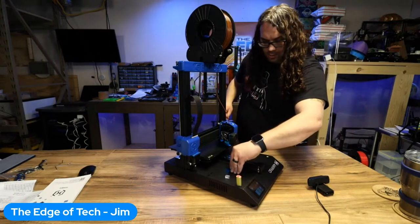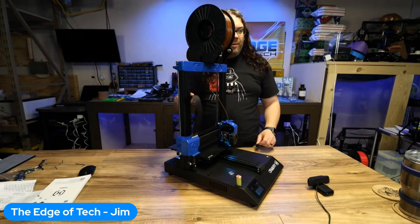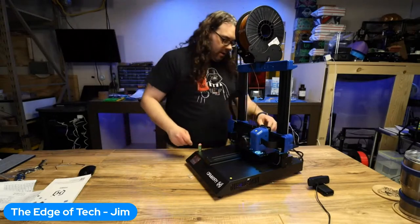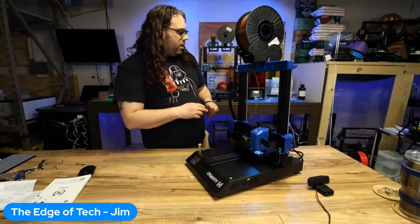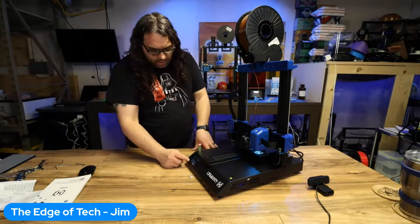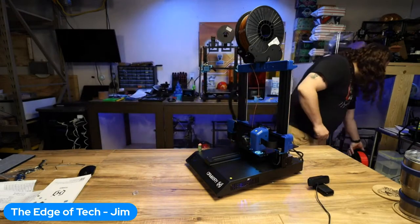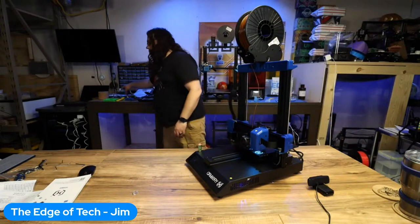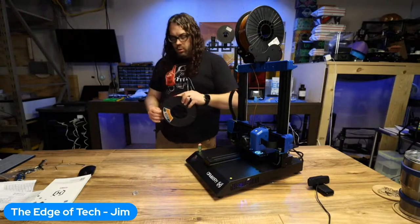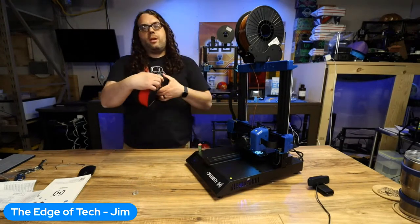Let's see. It's a little better. It actually twangs now. Blue tape. Yes, I did not win. I'm probably going to throw some Coex on it, maybe. It might just be trying to burn too hot. For argument's sake, I'm going to throw some Coex on here. I know I can burn Coex a lot hotter. So let's do a change filament. It's going to preheat. While that's doing that, let me grab some Coex. There's some right there. So this is a mystery spool from Coex.